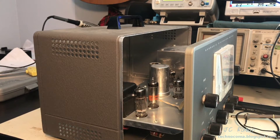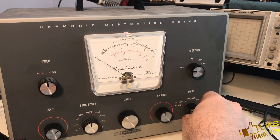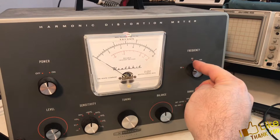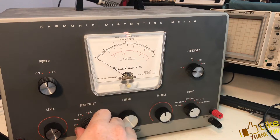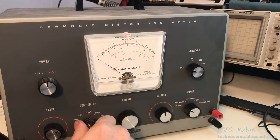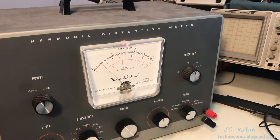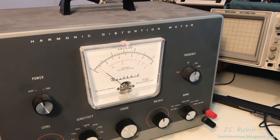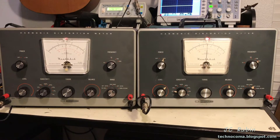For the last step I put the case back on the unit, turn the switch down to the 2200 setting, and set the frequency to around 60 hertz until I see some deflection. I bring the sensitivity down appropriately to capture that, then adjust the rear potentiometer for the minimum deflection. Everything's calibrated.